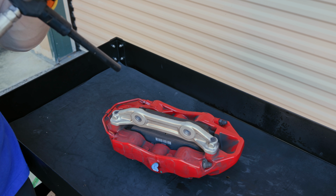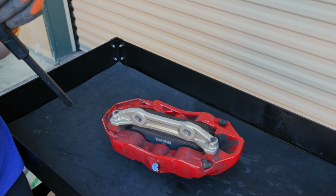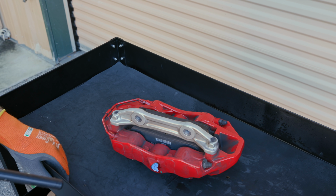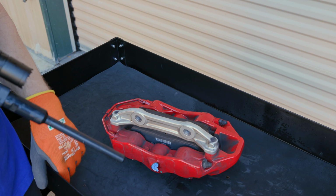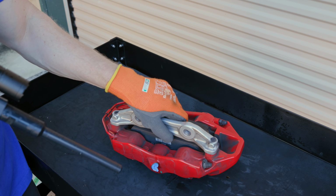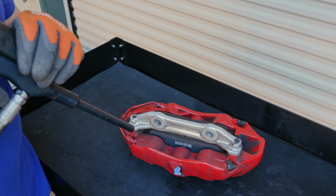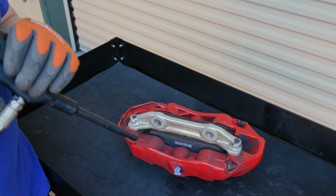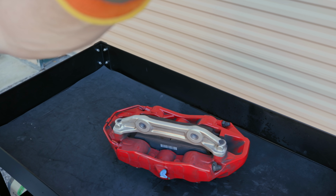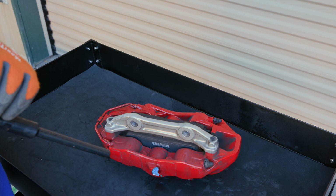But my 5-horsepower compressor is able to do this. This is a 2-stage silent piston FIAC compressor. It's about a $5,000 compressor, something like that. And you would really want some more. I think mine delivers about 28 or 29, 30 CFM. The more CFM you get, the more this will do. It'll remove adhesives and other things off. So in a perfect world, you'd have a bigger, heftier horsepower compressor, plus you'd have a desiccant dryer, so that way you can get rid of the plume, and you would do it in your humidity controlled garage.